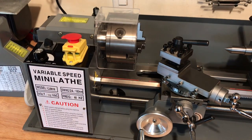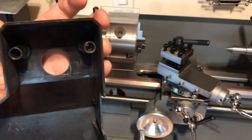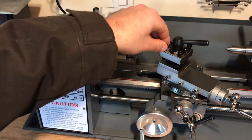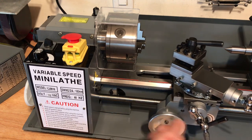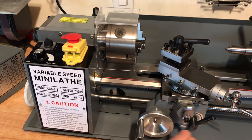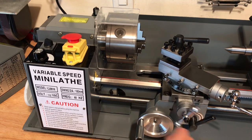The plastic on one cover was broken but I was able to crazy glue it back on — nothing critical. I did have to re-thread some screw holes and re-thread some of the cap head screws. You have to soak the cap heads; there's grime and grime and grime. I did have to shim the cross slide here with some washers as it was not working well. I probably had about 30 hours in it from start to finish — taking apart and putting it back together.